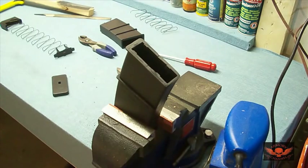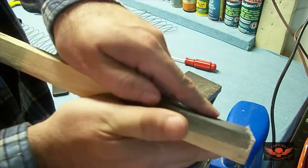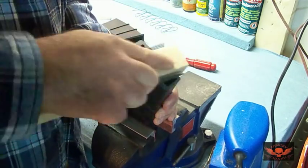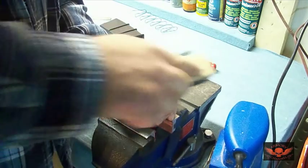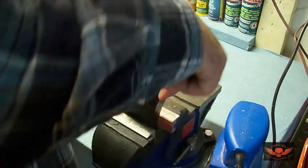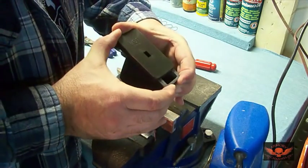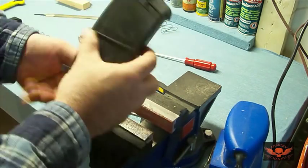All right, we're back — just done sanding. Good sandpaper like this drywall type works well. Wrap it around a piece of wood, hold it nice and flat, and it won't take too much off at once — that's what you want. Nice and perfectly smooth, just take the burrs off the sides real lightly. Now we'll see — you want it to fit tight but not too tight, you want to have to push it. Floor plate goes on — beautiful, floor plate is on.